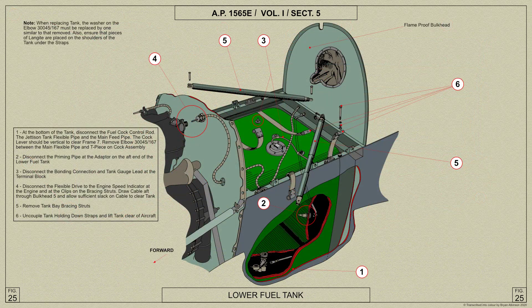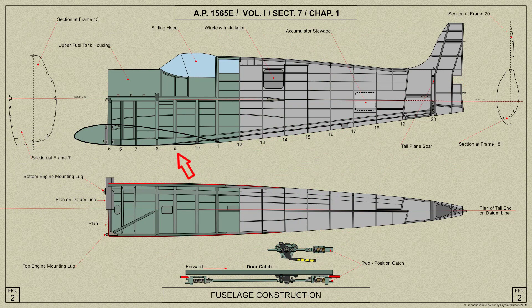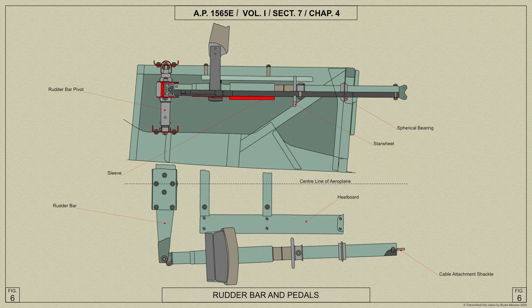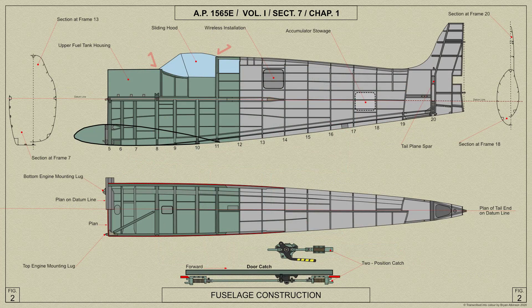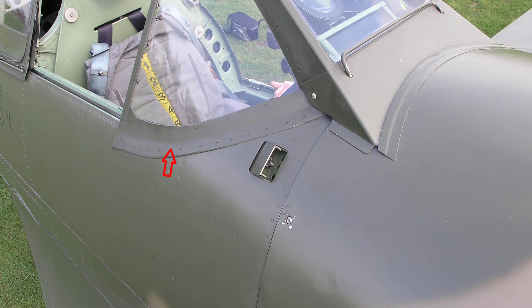The bottom of frames 6 and 7 are lined with cork and form bearers for the lower fuel tanks. Frame 9 is braced near the bottom by a transverse member and two diagonal struts, with further bracing members extending forward to frame 8. This bracing carries the mounting for the rudder bar sliding tube bearings and also for the rudder bar pivot. Above the top longerons between frames 8 and 11, a combing is fitted to form the cockpit fairing, supported by an arch-shaped member at frame 8 fitted with anchor nuts for the attachment of the instrument panel.